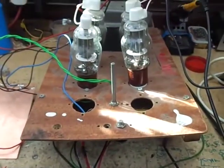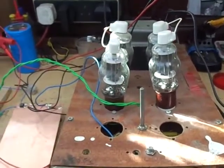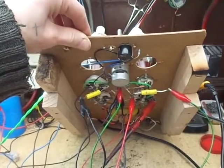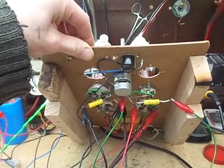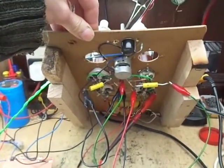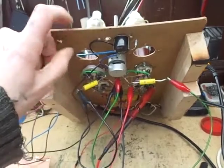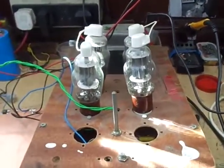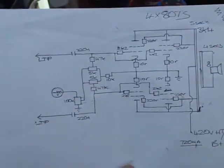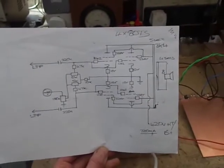The heaters are wired in series — all together there's about 25 volts. That's easier to wire that way, although it's not a brilliant idea from a hum cancellation point of view. Like I say, this is just a quickly knocked-together stage just to get an idea of what's what. At the moment I've grounded the connections to the coupling capacitors because that was causing the amplifier to go into oscillation. I'll go into more detail on load lines and all that in the next video. Thanks for watching.